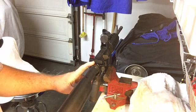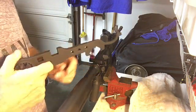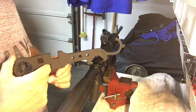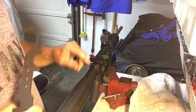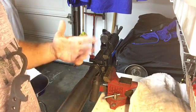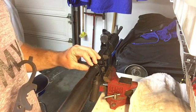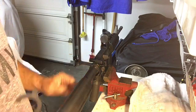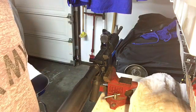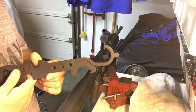First of all, if you're going to remove the castle nut on your AR, invest in a good armorer's tool. This is the one I purchased. You can get these things online and in different places for ten to twenty dollars, and it's worth the investment. Do not try to remove this castle nut with any other kind of tool. I've seen people using various methods — wrapping tape around channel locks, using adjustable wrenches — and you're just going to cause damage to your castle nut and maybe even further damage to the gun. These things are expensive and you don't want to wreck your expensive gun, so make the investment and get yourself an armorer's tool.